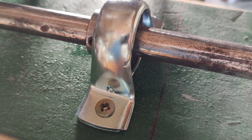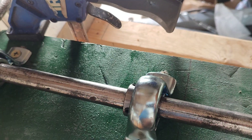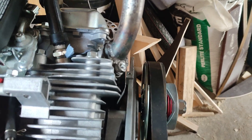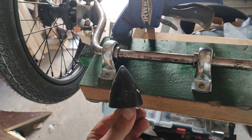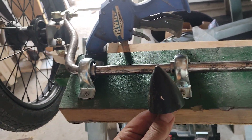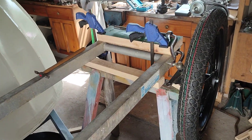The lower arm will have, at that point there, welded to it some kind of lever going in that direction, and it will bear against a conical rubber spring. These are my first pot of coal — massive elliptical bump stops. We're going to give those a try and see if we can make those work. And if we can, I've got a front suspension system — and here's the big thing about this car — because it's the Auto Union, which had that kind of front suspension.